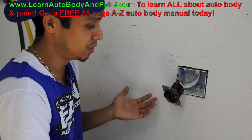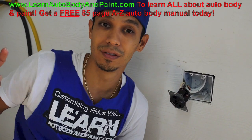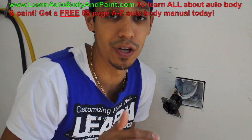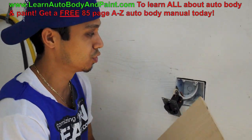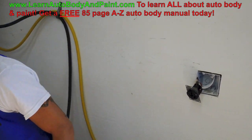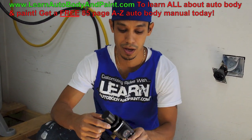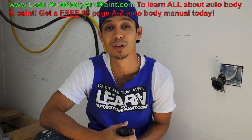So that's basically it. We switched the wire around. It was only getting 110 volts. Now it's getting full power and it runs really good. So let's put this thing back together, fire it up, and I'll show you the difference in how this thing runs. Then after that, we're gonna go ahead, screw this piece of wood to the wall here, hook up our regulator and water filter, and hook the hose up. We're gonna hook everything up so we have air coming out of our compressor and usable air in the garage.